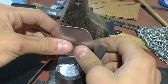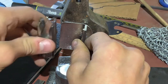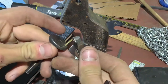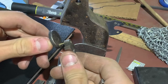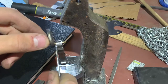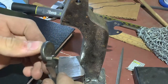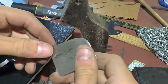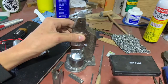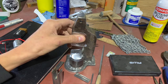I think it's going to be better if I weld on this plate first and then the guides get welded onto this plate. That will make the ram stick out a little bit, but it should be fine because I do have enough room on the crankshaft for it to slide out. It will only slide literally about a sixteenth of an inch. So next I'm going to weld on this - just tack it in a couple of places and that will be good to go.